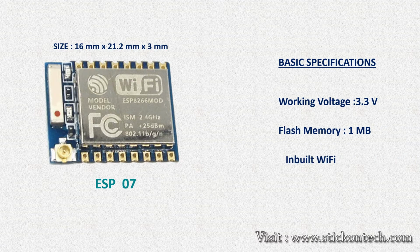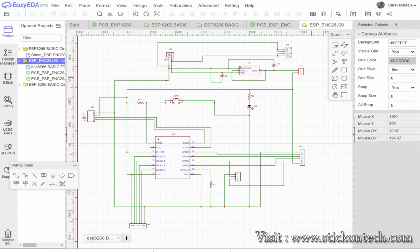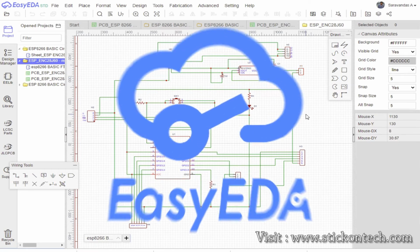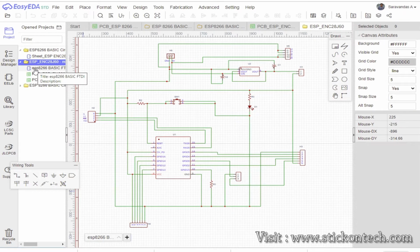First of all, we have to design a circuit diagram with the proper component values and measures as shown. Once the designing completes, we can convert the circuit to its corresponding PCB. We are using EasyEDA for circuit and PCB designing. In EasyEDA, we can create a new project and sketch the circuit. If you are a beginner in EasyEDA.com, check out the link in the description for how to design and develop PCBs using EasyEDA.com.